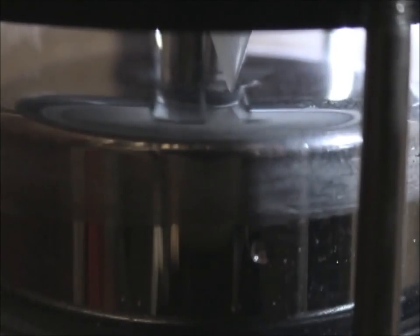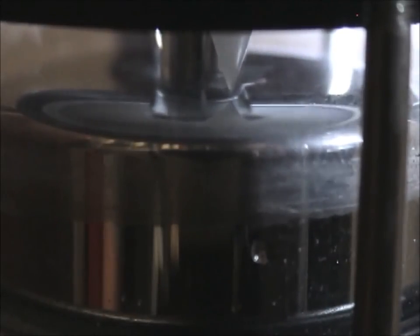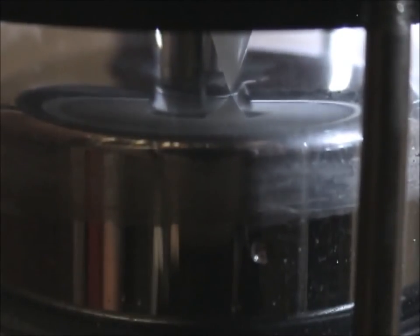Now I want to show you how to adjust the mercury level by turning the brass screw clockwise. I will bring the top of the mercury up against the bottom of the white pointer. I'm doing that right now. And eventually you will see the white pointer push into the mercury and create a dimple in the mercury. You can see how much precision goes into setting this instrument.